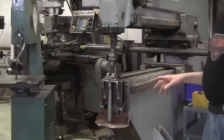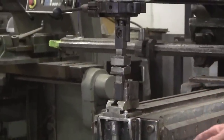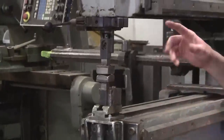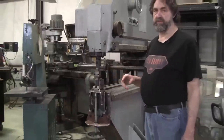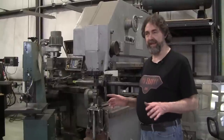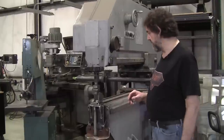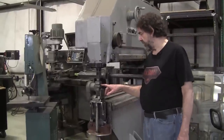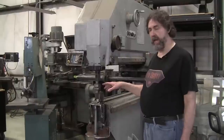So this has what's called the thumbnail dies in it. And thumbnail dies, well, a lot of people see thumbnail dies and they say, oh, that's so much better than the kick shrinker. And there is also, on the kick shrinker, there is also the Eckold powered machines, which are very expensive. I've never used one. Everybody tells me they work really good. The bad thing of them is they make marks on the panel. And I particularly don't like the marks on the panel. These will make some marking, but it generally will clean up, depends on the die.